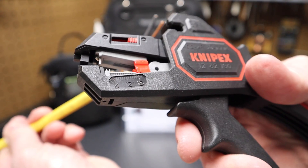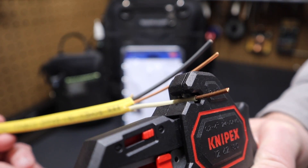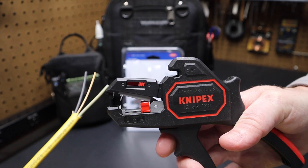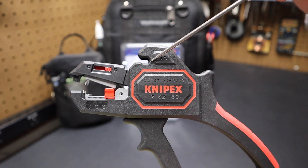And of course, we have that wire cutter on top. We can just push our wire right through here, and you can see how that wire cutter works — it just pulls right down through the wire. So you've got a convenient wire cutter right on top of these wire strippers. Now the cutter on here is for soft wire, so it's designed to cut aluminum and copper. This length stop on here is replaceable, and so are the cutting jaws.